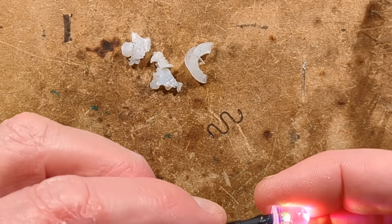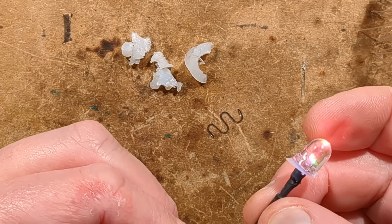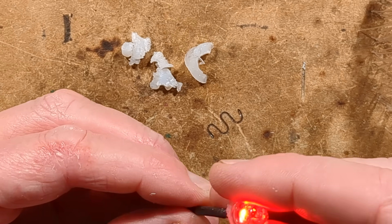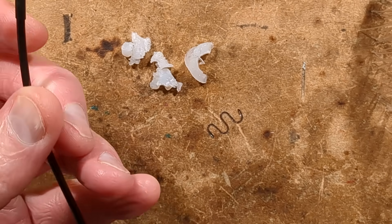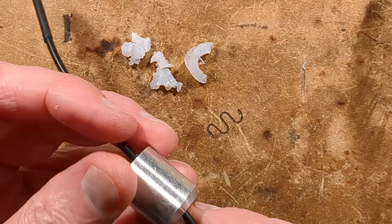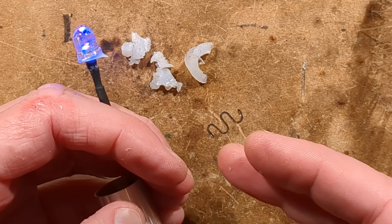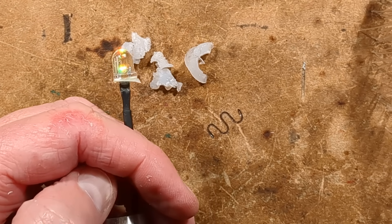The hot melt glue is out and I'm not actually seeing a resistor. It might be one of these LEDs that's designed to operate directly at 12 volts with a built-in resistor — interesting. Let's experiment and stick another LED into the end of this to see if we can get a more pleasing effect, perhaps white or maybe even a fairly high power LED.